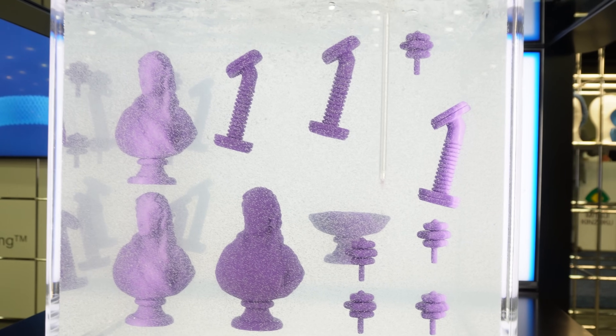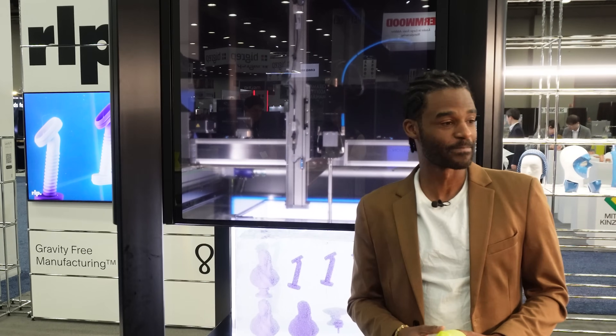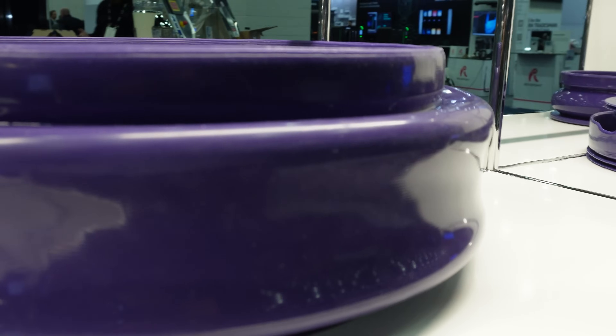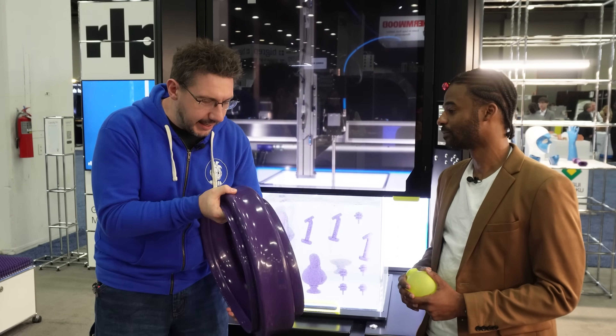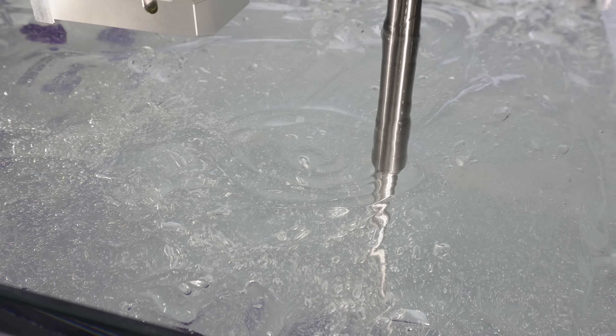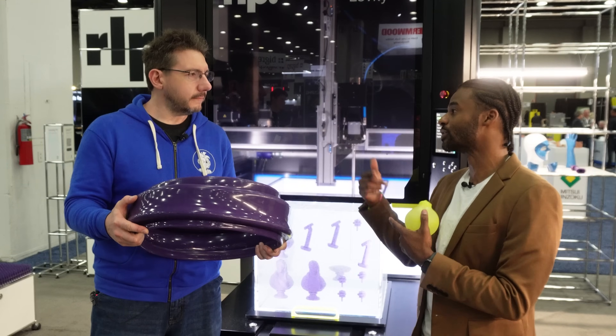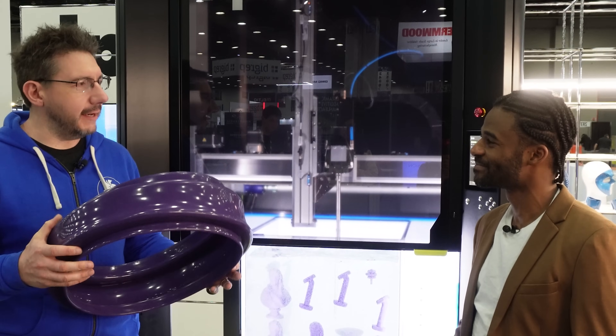I see these parts — you're doing some parts for a trade show and those are hours away from curing. Look at this part printed in your machine. How long was this to print? This print is actually 200 minutes — a little over three hours. And you've got a fully printed, full-size, one-go, completely printed still system in silicone. There's a hint of a layer line, but you guys have the extrusion so dialed in — this is smooth. As it's printing, it's still a liquid, giving it the opportunity to blend. We let it stay liquid as long as possible so it becomes homogenous and has isotropic performance. So you are 100% isotropic dense silicone.